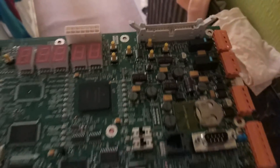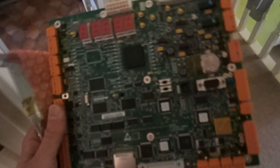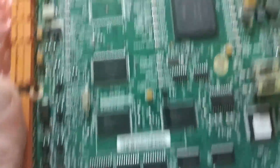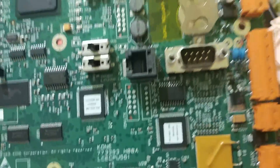Okay, that's the processor. I've looked up all of the chip numbers on this board. We've actually done a lot of research, and not just me — all of the team, including many people from Germany. We're getting very close to completely reverse engineering this board. This main chip is a processor; it's not particularly fast and doesn't have any onboard RAM or storage. So that's just your basic processor. Then here you've got the BIOS or ROM chip, and then you've got two chips of flash memory called NV RAM. There are many many other chips, and most of the others deal with inputs.